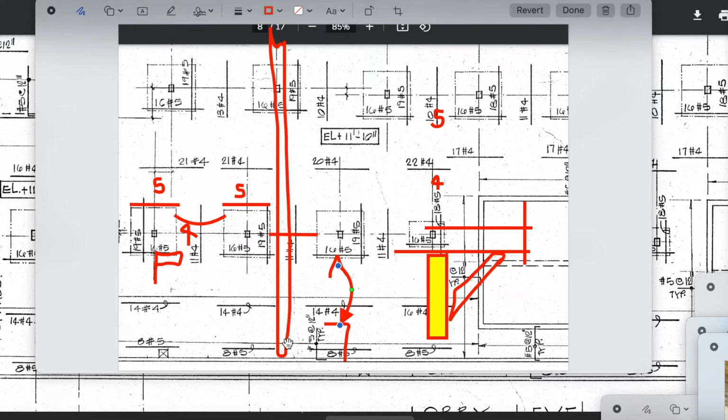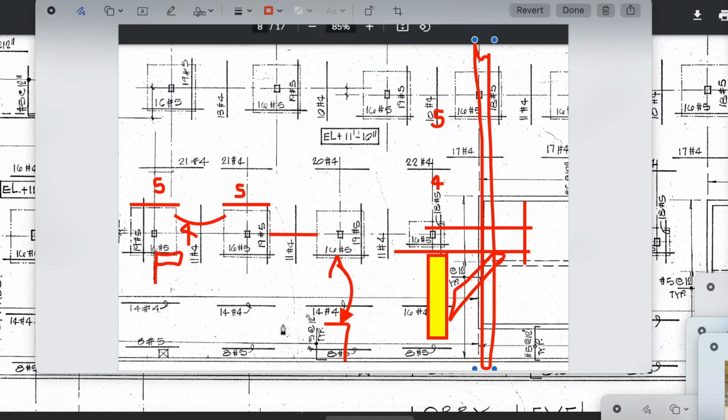So now I want you to section this, when I talk about section, all the way back. So you can move this aside now. Considering this would be my cantilever effect. It gets worse if you don't consider it and you come back to here. But considering that, you're going all the way up to this one. And now you got your sag area. But resist it by in here, this number 4 that was taking its own little span issues. It now has to take this on because there's no extra reinforcement here that creates a beam. It now has to take on this span, and the midspan from here to here, if you can visualize it. And this will be my critical shear zone, my cantilever. And this will be the cantilever above the head, theoretically.